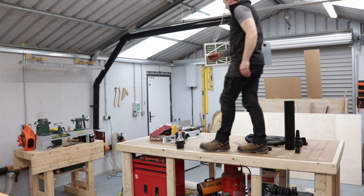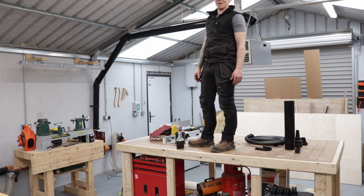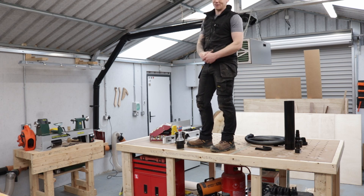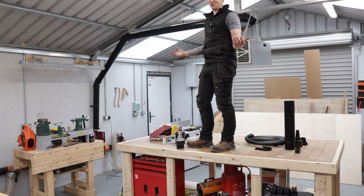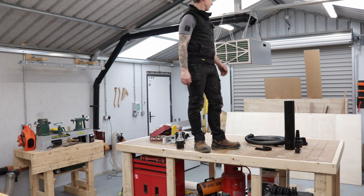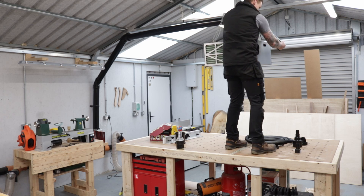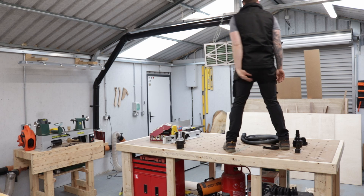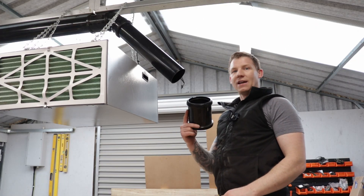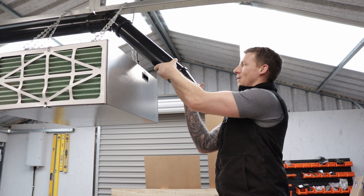Here we are up and over - just like I did in my last video - a 45 and a 45, nice and easy. I'm going to cable tie it to this beam. I've cable tied cables that weigh hundreds of kilos to cable tray rack and 20 years later they're all still hanging from the ceiling, so a little bit of pipe weighing maybe two kilos total is going nowhere. I've added another 45 here to angle a piece of pipe down so I can reach the end to attach and detach my hose. I'll use a coupler with a rubber seal either side to put my reducer in.